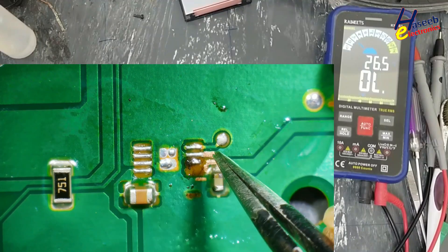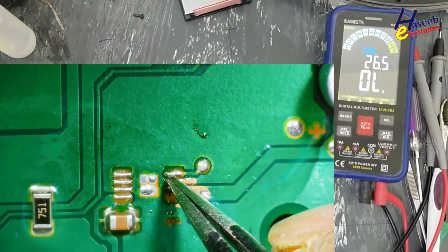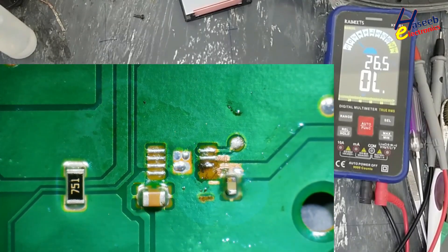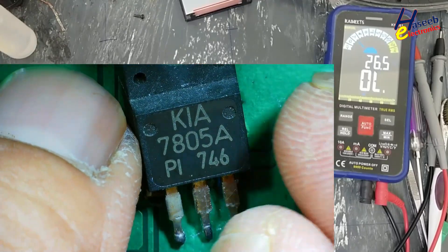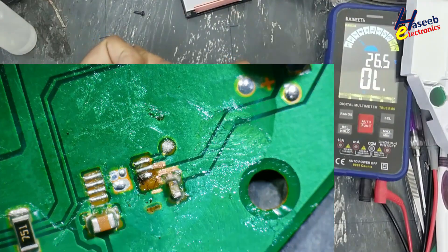This is the output pin, positive input here, ground pin, and here is the frequency setting capacitor — not installed. So we just need any 5 volt regulator that will work normally. Because the PG signal is not working here, I will use a regular 7805 — it will work here. I will install it here. The original regulator maximum output current is 150 milliampere and this one its output current will be up to 1 ampere. We will not need input or output capacitors because there are already capacitors used here.